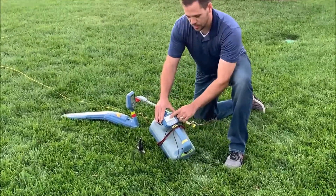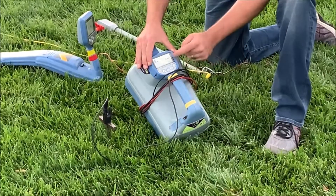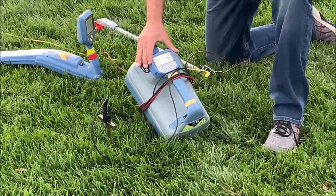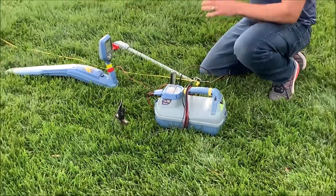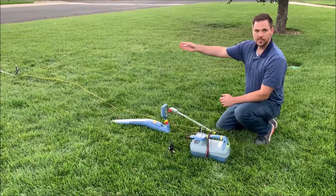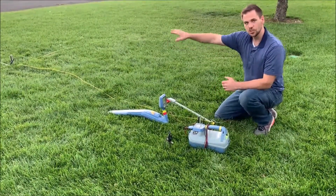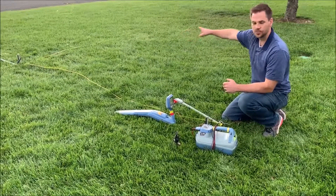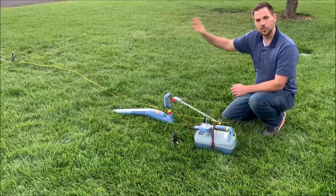As you can see, we are in 512 hertz, which is low frequency, and we've got about 50 milliamps going out on this line. Something to keep in mind: our devices allow you to locate from this device to the next grounded location — that being the triple. I should be able to easily locate this line, but the signal should not go to either upstream or downstream, because all of my signal is going to go to that next grounded point.